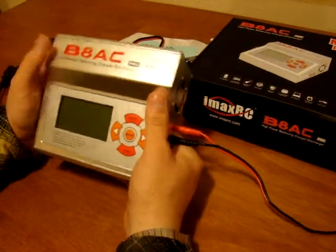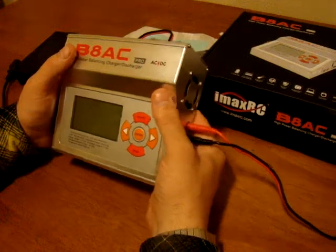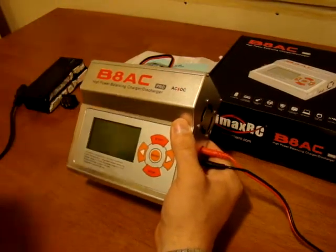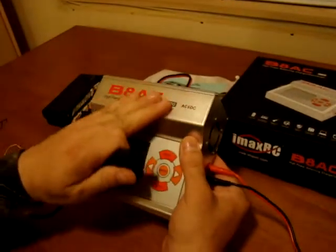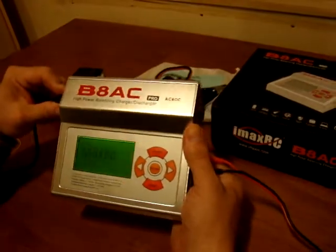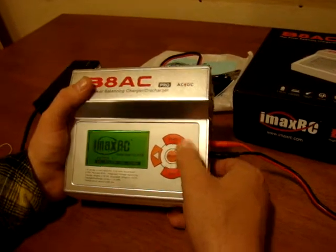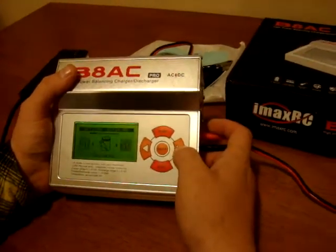After that modification was done, I charged a car battery running a 10 amp current — no problem. I didn't charge it completely, but it went pretty good, and half an hour later you can touch that aluminum — barely warm, no smell, nothing. Before the modification it didn't smell like burning plastic or anything, but you could tell it was quite hot.